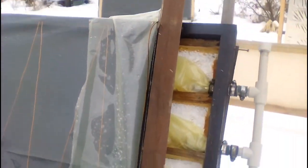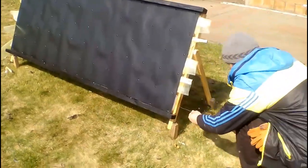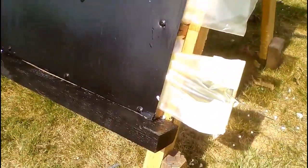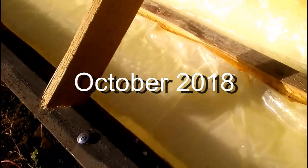These polymer sleeves will age due to high water temperatures, but the good thing is they will be completely covered from UV destruction by the sun, although here we see small uncovered zones of the sleeves which we have to cover. We have the ability to replace sleeves, but an old sleeve may slightly stick to the steel sheet, making removal more time-consuming. If the water temperature is less than 40 or 50 degrees Celsius, replacements will likely not be needed, because 10 years of lifespan corresponds to approximately 20,000 hours of operation with warm water. I recommend increasing the thickness of the polyethylene compared to these sleeves, which have a wall thickness of 100 microns.